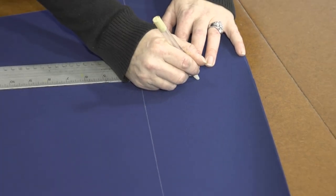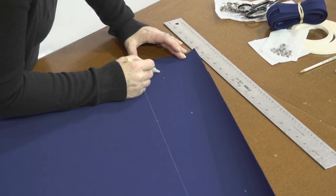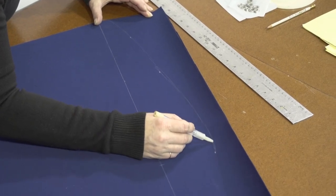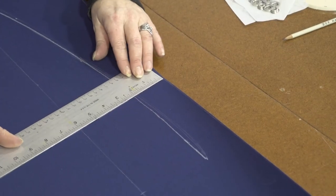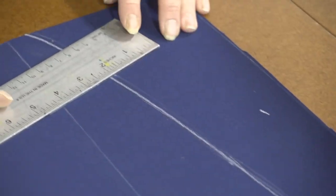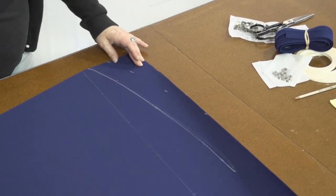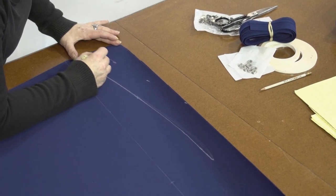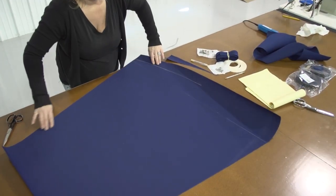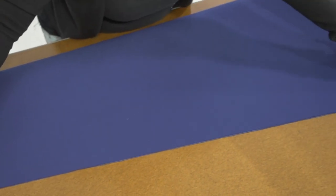She's going to have to strike lines again 2 inches above the line she's striking now to create the arch, so you can do it either way. Now she's going to freehand an arch, matching up with those lines. She'll need to do the same thing again 2 inches above this point. Now she's going to measure up 2 inches again and repeat the procedure. Notice that we are not marking the opposite side of the arch — we'll fold this in half and cut along this line, and then we'll use that new cut line to create the arch on the other side so the arch will be the same. Angela has created a cut at that half arch, she folds it in half, and now she'll cut the second half of the arch.